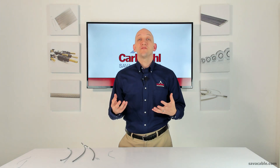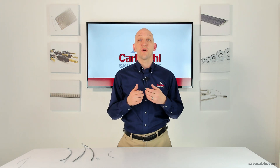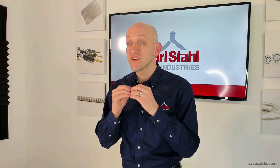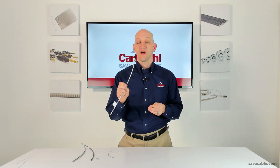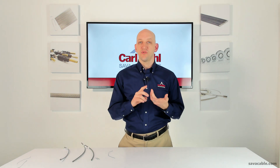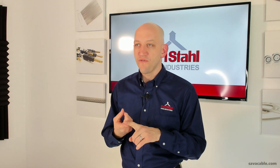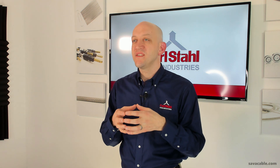So how do we solve this problem? The answer is that the cable is electrocut. Electrocutting is a process where the cable is put into a machine and hit with an electrical arc. The intensity of that arc separates the cable into two pieces. An added benefit is that it actually fuses the wires together, so fraying doesn't happen. However, the electrocutting process can still introduce burrs or deform the cable end. Through a skillful electrocut, you can fuse the wires so there's no fraying, no burrs, and the cable maintains its concentric shape.